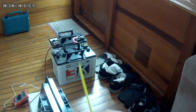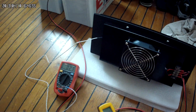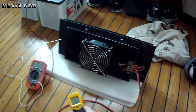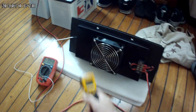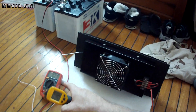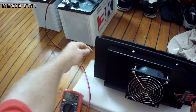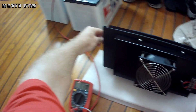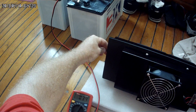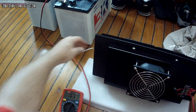I've got 60 amp-hour batteries in series giving me 24 volts — this is a 24-volt unit. We started out at 32 degrees Celsius inside the boat. It just started up so the heat sink isn't cooling that much yet, but the cold side is already down to 23 degrees and still dropping. The hot side is putting out 34, 35, 36 degrees and the temperature is still increasing.